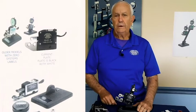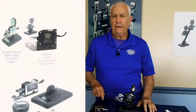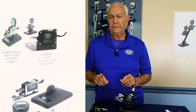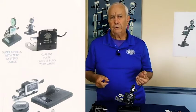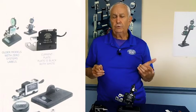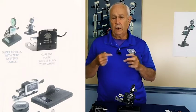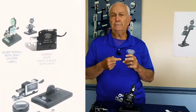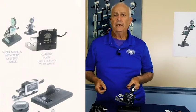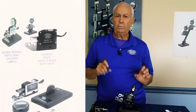Now this is a very important part of this. Let me explain. Within our system, within our standards, the ASME B1.3 has 3 levels of acceptability for screw threads: level 21, level 22, and level 23. Level 21 is the functional acceptance of screw threads. It simply uses go and no-go fixed limit gauges. If a screw will go into a go ring, it's functionally in size at the maximum material limit. If it will not go into a no-go ring, it's functionally in size at the minimum material limit. This does not necessarily, though, mean that that thread is in size at all aspects or all points on it.